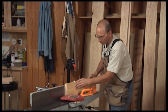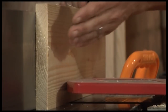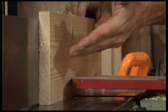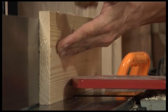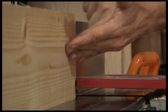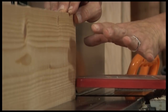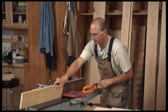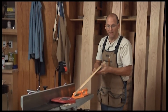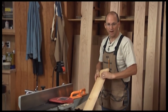You'll notice that when I push the material across I got my hand away from the area above the knives and then came back. I'm applying pressure to keep this edge of the board true to the fence — it's all a matter of keeping everything in contact right past the blade. That's the most critical part of the jointer. So this board is faced on the bottom and jointed on the edge and it's ready to go to the planer.